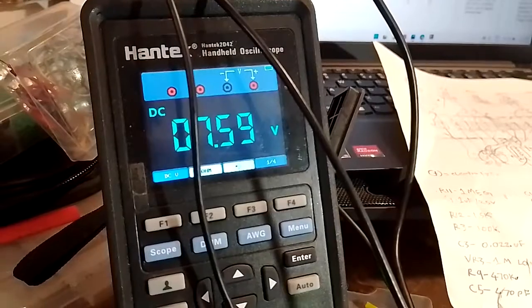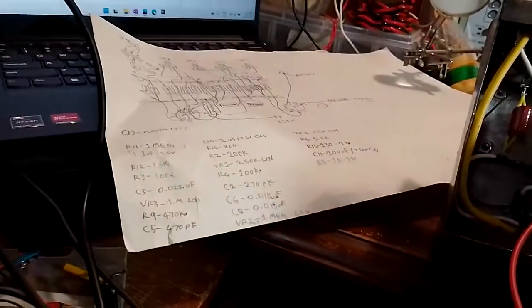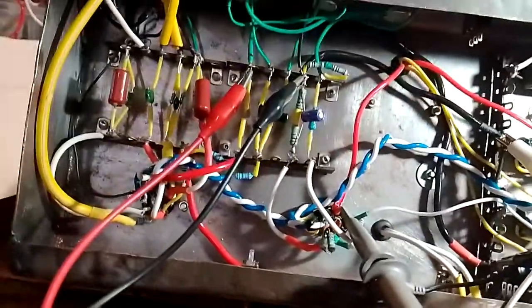So yep, that's good. Let's turn off the signal generator, and I'm curious now about the screen voltage. What should it be? It should be 239 volts. So let's go back to DMM. Where is the DMM? It's still on the cathode, and let's move that carefully to the screen. So where is the screen going to? Yep, from here.